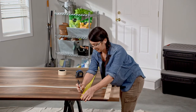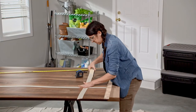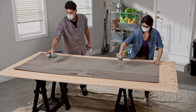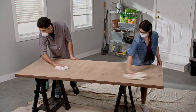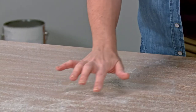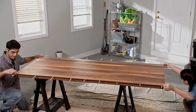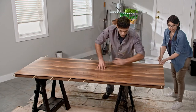Just like when cutting the edge pieces, measure and mark the laminate for the door front ⅜ to ½ inch larger than you need on all sides. Place masking tape on the laminate along your cut line to avoid chipping during cutting, and cut with the jigsaw. Then remove the tape, clean the laminate, and spray the laminate making sure you have full coverage. Clean the door surface with a dry cloth, then spray the door surface with adhesive making sure you have full coverage. When the adhesive is tacky, place your dowel rods 10 to 12 inches apart on the door surface, and put the laminate on top of the dowel rods. Be sure to align the surfaces so the overhang is even and parallel with the door. Now slide the dowel rods out starting in the middle, smoothing the surface with your hands as you go.